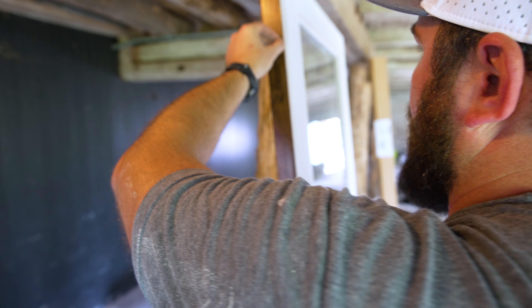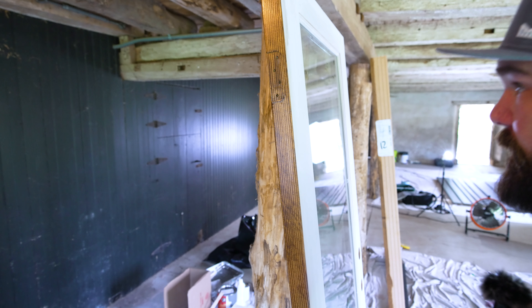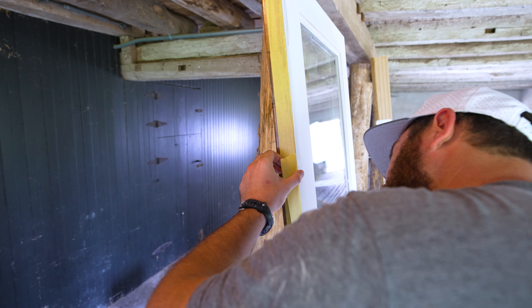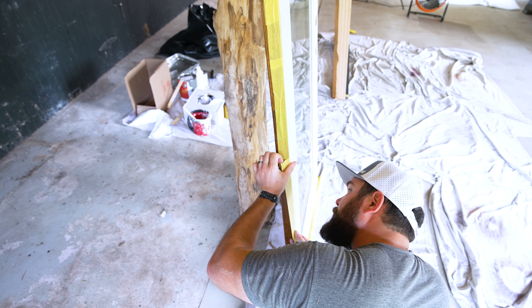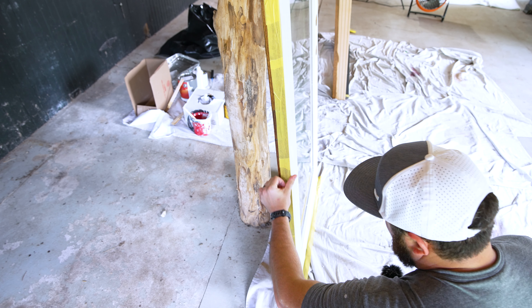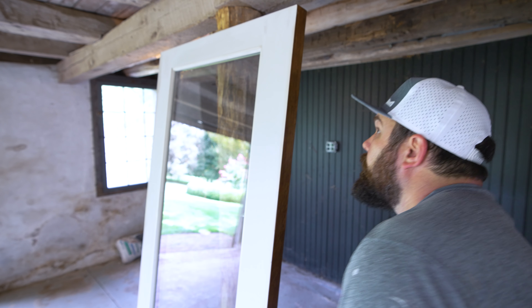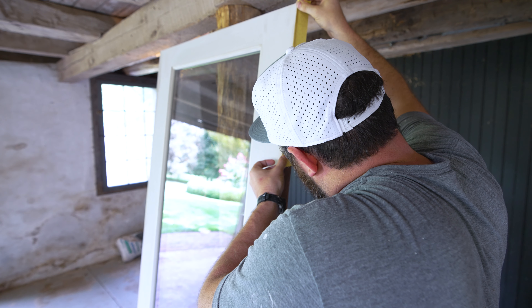This is the edge I'm taping. I just want to keep this kind of factory line that's here. Since I just polyed this and it's all dry, taping it is going to be my best move. In general, I find it's easier on this kind of taping to do little pieces because I'm really trying to have a clean line here — similar to putting decals on Legos. Just make sure you really use your thumb or finger to seal in the edge where the tape meets the paint. Seal it in super good. Same process on this side, use small pieces to get your clean line. I like to keep the tape nice and taut as I lay it in, which helps you get a nice clean line.